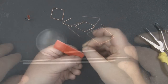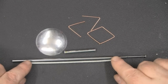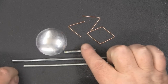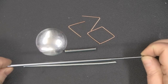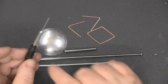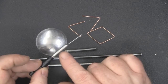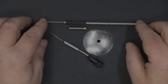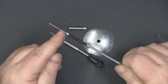Now we've got the main parts of this antenna prepared, we're going to start constructing it. I've got a piece of semi-rigid coax that's 130 millimeters long. I also need some metal tubing — I've got this from cheap telescopic antennas from a pound shop or from cars in a wreckers yard. We need to recreate the tubing here on this dipole, because this antenna is effectively based off a simple dipole, which is why the wavelength measurements are the same.